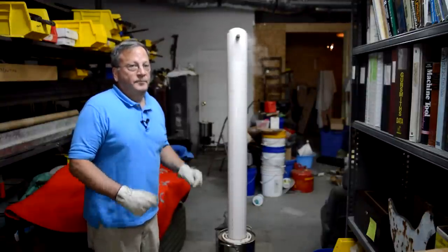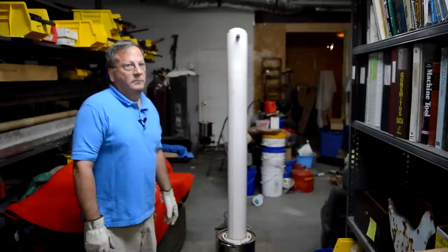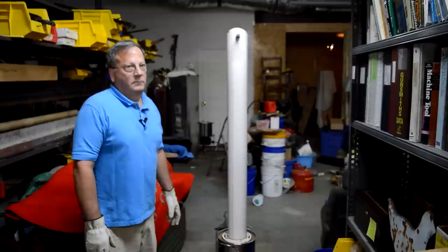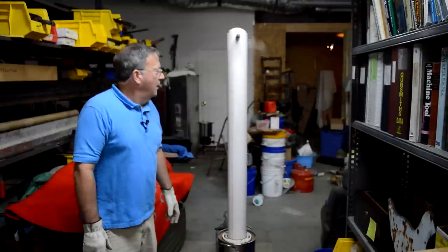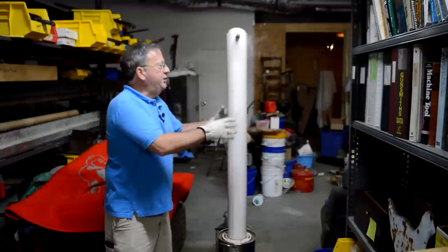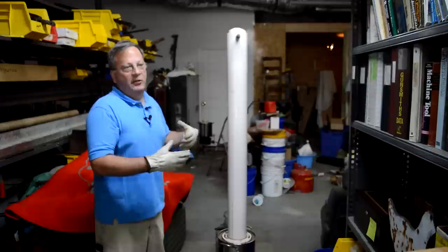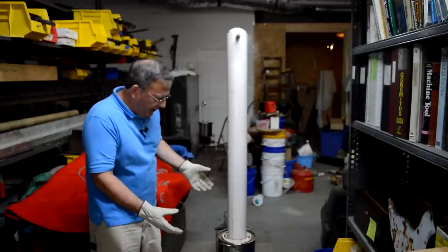And not only that, it's a very consistent process. Accelerated rust bluing is consistent. Unaccelerated, natural rusting depends upon the natural humidity in the air. It depends upon a lot of stuff that you can't accurately repeat. And when you're in business, that just doesn't fly. So industry, with access to steam in the plants, used steam to convert the oxide on the metal instead of boiling it in tanks. So what I've done here is put together a very inexpensive outfit.